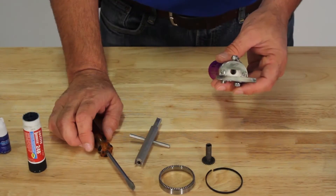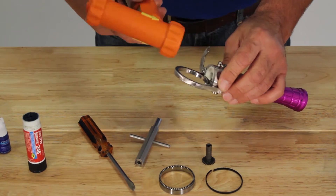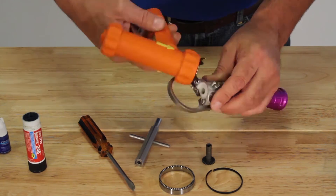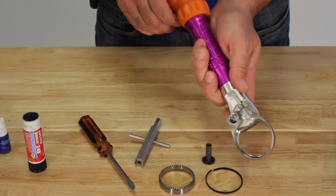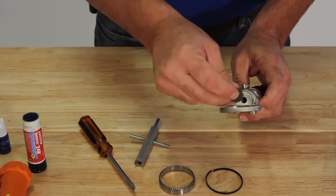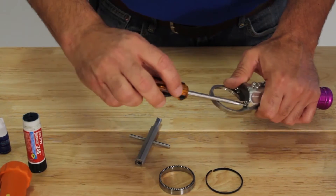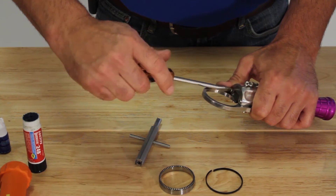For cleaning the tool, you'll want to open the cam or the pinion cover. Run hot water through the bushing, around the housing, and through the handle to blow out any excess debris. Replace the pinion — put a thin coat of mineral oil on the pinion to ensure it does not rust, and also a thin coating on the housing.